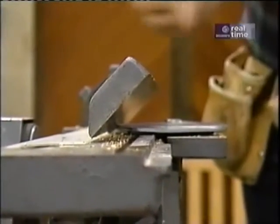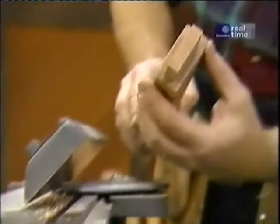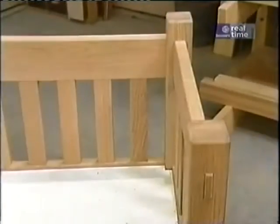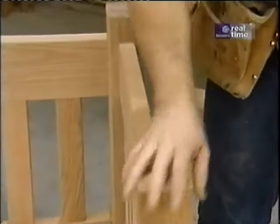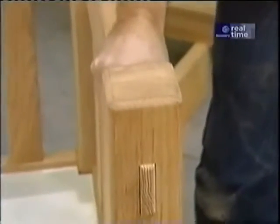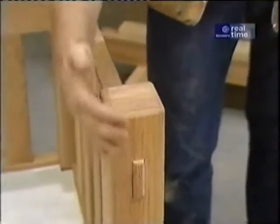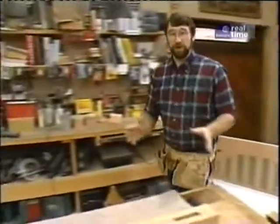What I've done now is tilted the fence on my jointer to 45 degrees, and that allows me to knock off the corners of the slats. You can't go by one of these pieces without wanting to touch it, and that's part of the craftsman style. So it's important that all the edges are eased — you don't want any sharp places to injure yourself. I'm going to start by easing the edges on the post using a three-eighths inch radius rounding-over bit and hitting all the sharp corners.